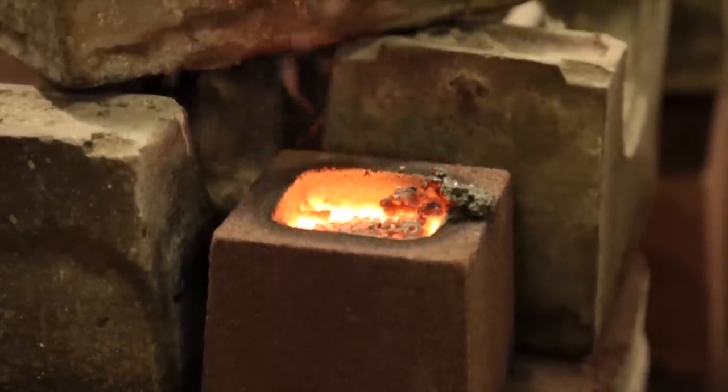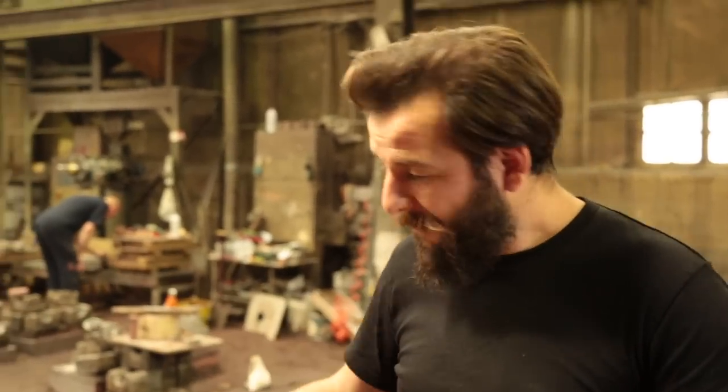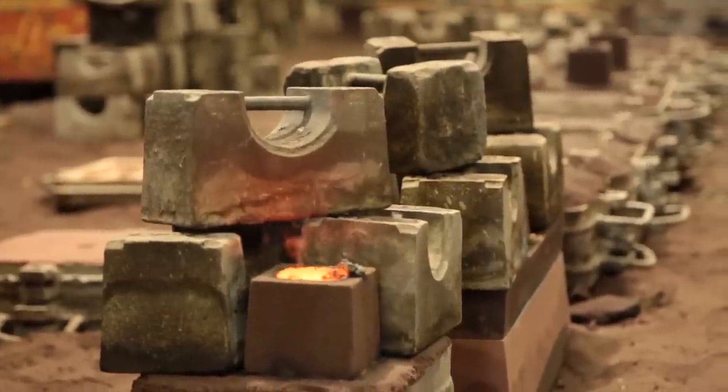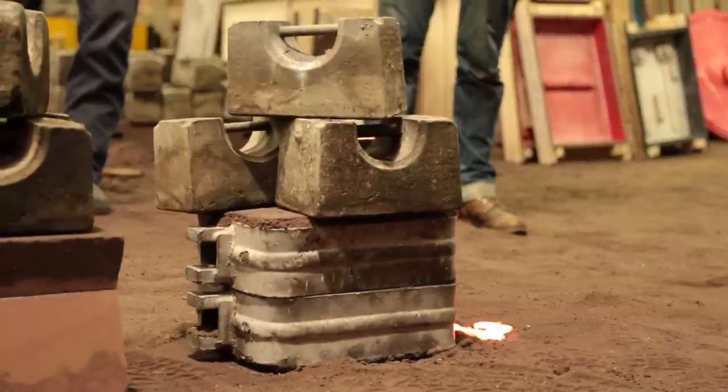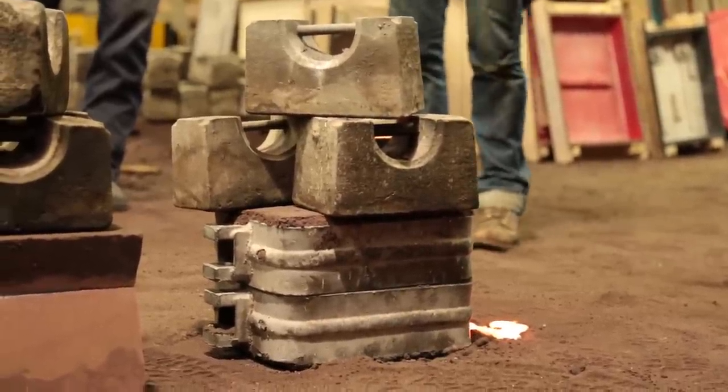That is so cool - that's 1,500 degrees of molten iron, poured in just like that. It's like fireworks. Ranala parts being poured right next to Jag parts, other engine parts, all being poured out of the same pot. This is absolutely brilliant. When you pour the molten metal in, how does the air get out? Basically with the sand it is self-venting because we use a grade 60 sand so it is porous - but we also put vent holes in the mould just to release it. As you see when we cast them, you do get a little bit of air come out anyway. We pour it in one end and at the other end there's a little chimney - sometimes we scrape a little line in there just to let the air come out through those little holes. Sometimes a little bit of metal does come out but it's not an issue - it's the way it is.